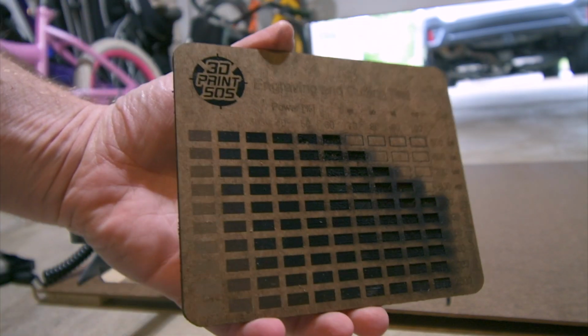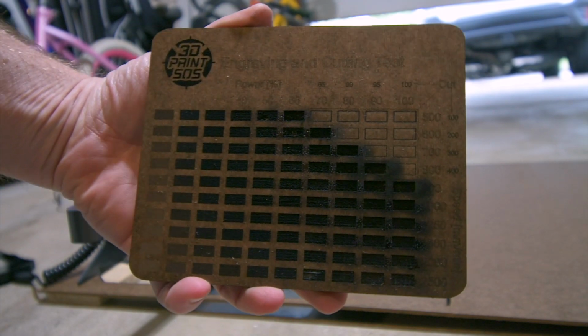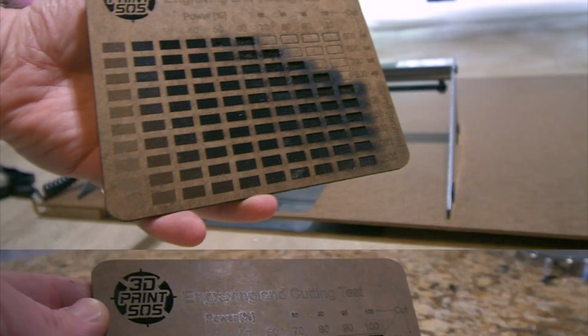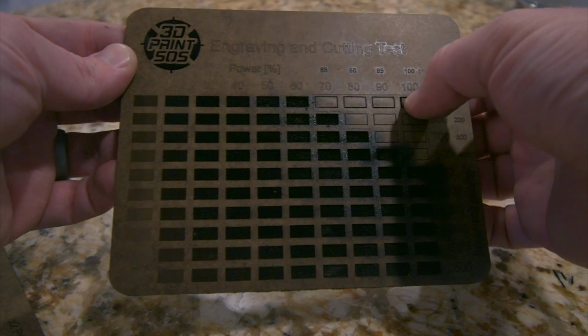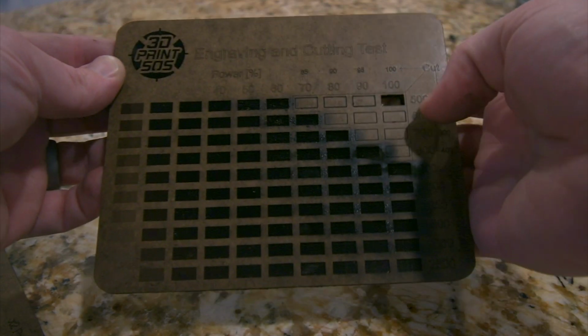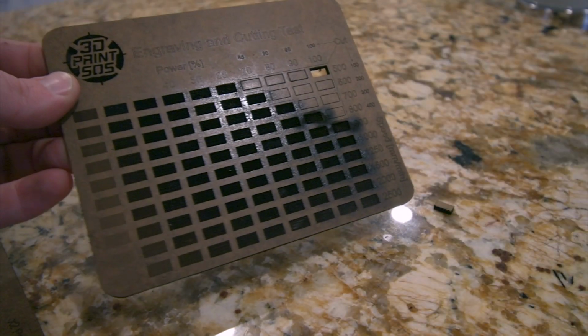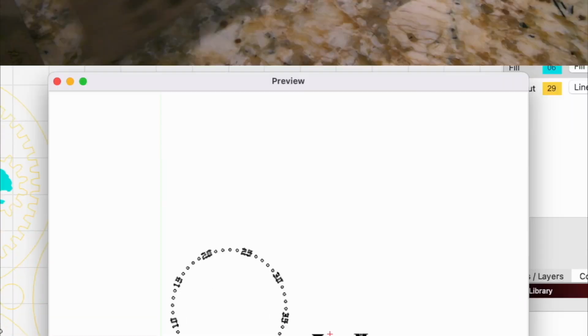All right, I'm gonna go ahead and apply some of these settings to something we could use, and we'll cut it out. I'll see you here in a second. Just a quick update. I just walked inside here, and I noticed with my finger I could push it. So if we just push enough, yep, falls right out. So 100-100 for this particular material can be cut in one pass. Good to know.